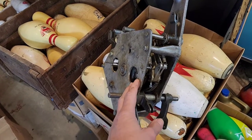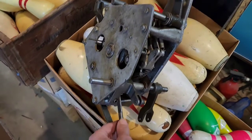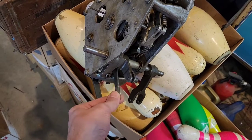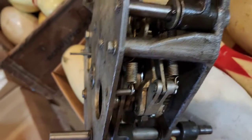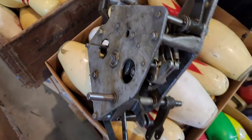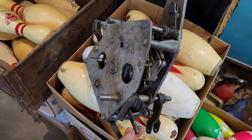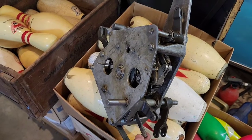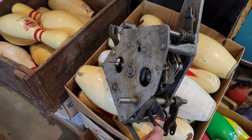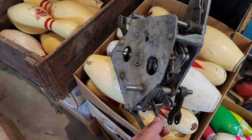That is how a Brunswick machine detects the difference between a standing pin, a strike, and an out-of-range — whichever it is, exactly at 90 degrees on the first ball, it detects that and goes one of three different directions. It's this detector rod right here, with all these gears, which is amazing that somebody engineered this back in the mid-fifties. There are no switches, no solenoids controlling this — well, those exist, but only for things like ball lights. Truly, a Brunswick pinsetter would run if you plugged in just the pinsetter motor and cycled it. You could bowl a full game — standing pin, strike cycle, everything — with just that motor spinning, because it's 100% mechanical.